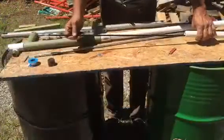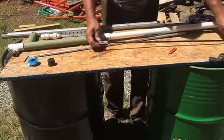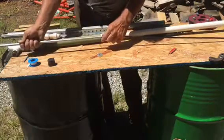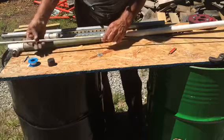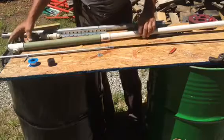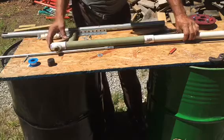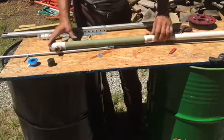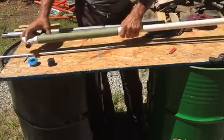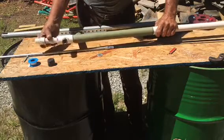We're back up here at the top end of the pump, and as you can see, we've got this much of the last rod sticking out. So what we will do, we will then screw in our top metal rod that will either go to your hand pump or in the future into an electric motor if you go that way. We have here our piece of 1.25 inch steel pipe with our T, everything hooked into it. I put a piece of pipe through it and glued this all solid so this comes out. So then what we'll have is your very top end of the fitting.